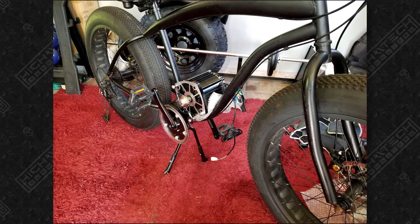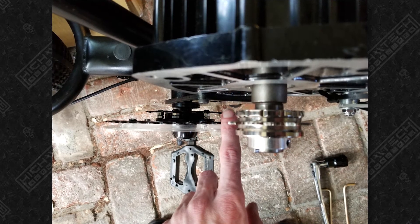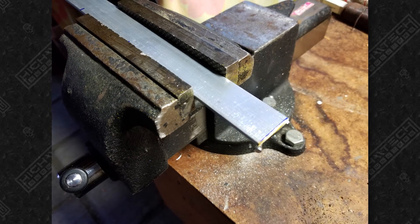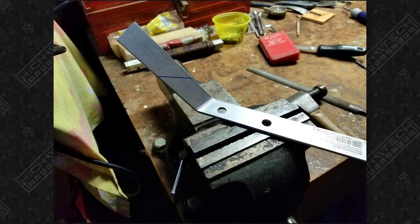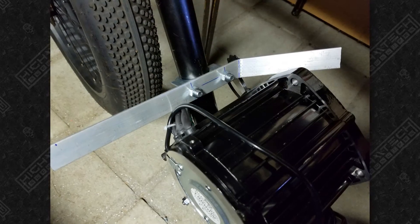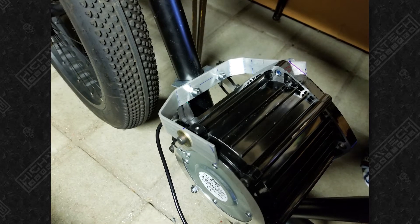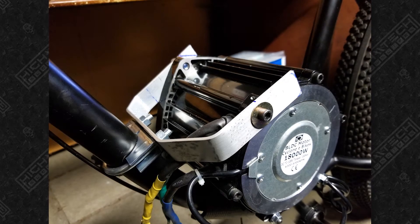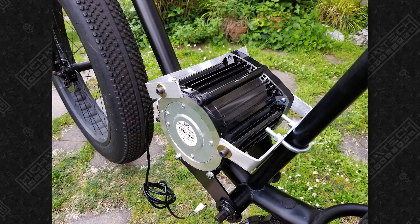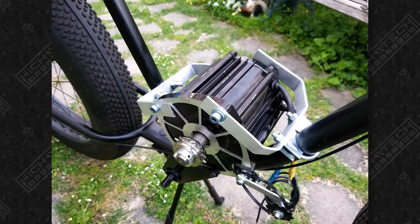It's a good thing this frame is so huge, because I am definitely gonna need the room. This is roughly where I wanted the motor, and now I had to figure out how to mount it there permanently. It's probably overkill, but I decided upon aluminum brackets with steel U-bolts. A lot of this was just improvising the angles and trying to get everything to line up correctly. There are quite a few mounting holes on this motor, so I had a lot of options. The original mounts to this motor are just to the bottom bracket — I didn't think that was enough, so I added two more mounting points for a total of three.